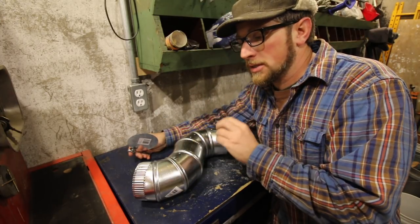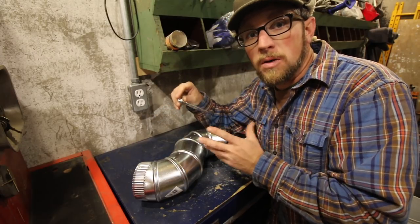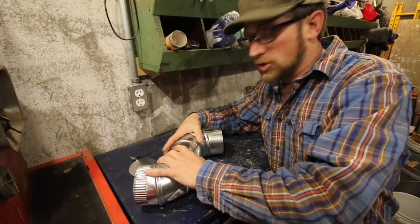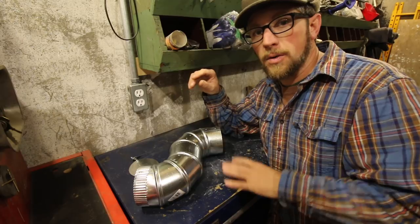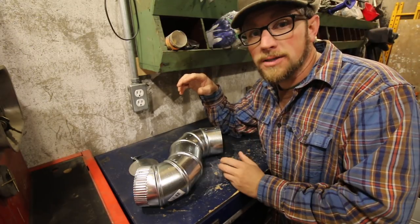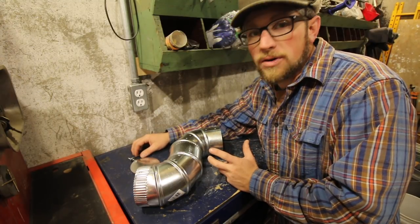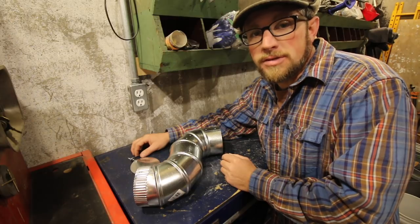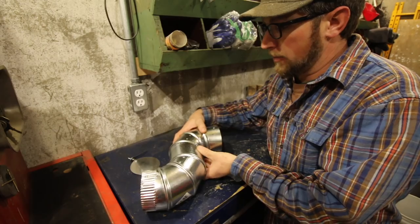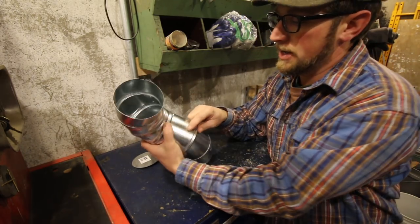The other reason for going with a 4-inch is the room is small, but also if you don't have a window you could still do this setup — you could drill through your sill plate. This is the size of a dryer vent, and dryer vents go through your sill plates. So you could pipe in one for a cold air intake and one for an exhaust. I think it would be awesome if a lot of people built these kinds of rooms. It's so versatile — you can use it in the summer for a root cellar or in the winter as a walk-in cooler.